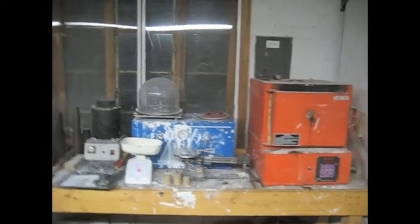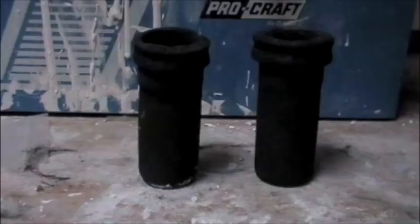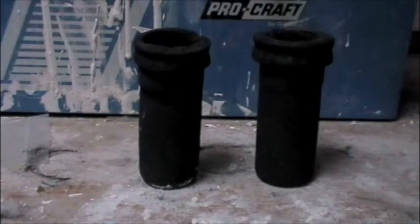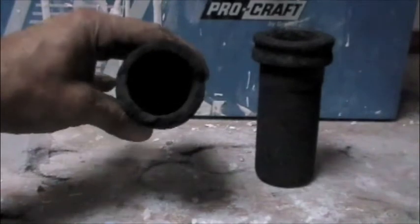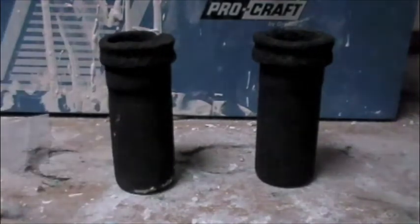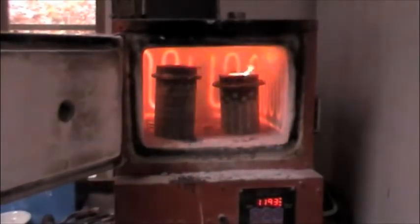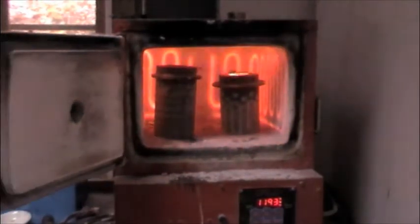Here's an overview of the casting setup: the melter, the vacuum, and the kiln. Here's the melter — it gets plenty hot in here, goes around 1900 degrees Fahrenheit. These are the graphite crucibles in which the metal is actually melted. Here's the vacuum machine, which you've already seen in action, and the kiln where the wax is actually lost. The wax is burnt out of the flasks at about 1200 degrees Fahrenheit. When it's burnt out, it leaves a space which is a perfect negative of the model. The sprue leaves a channel by which the metal can enter.